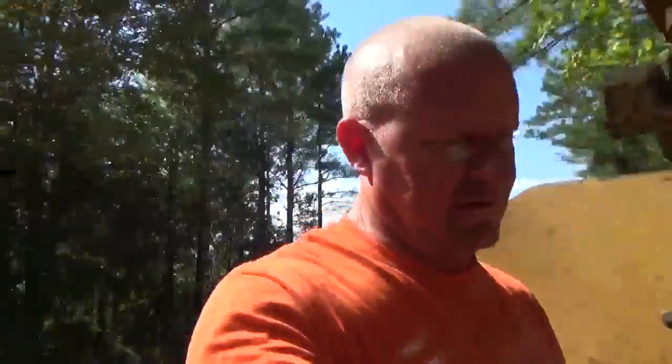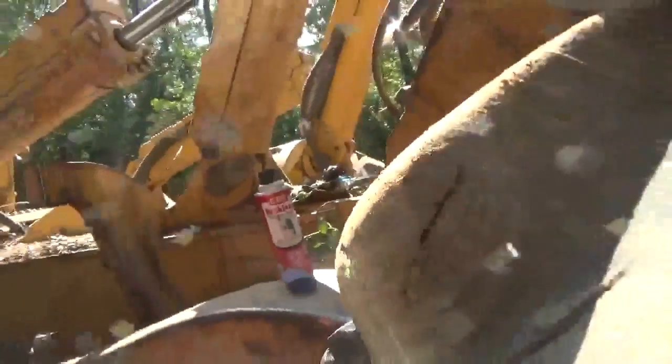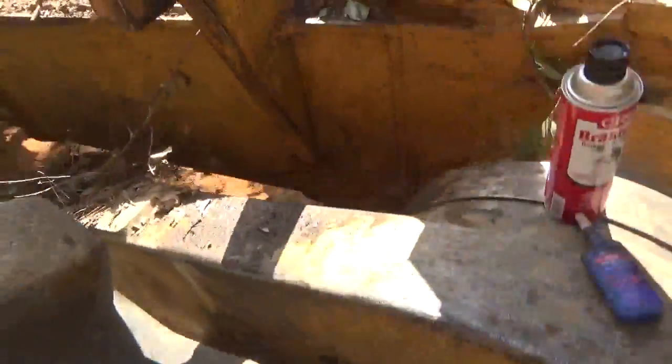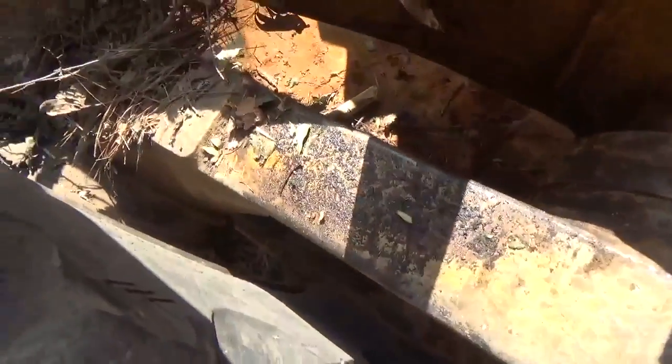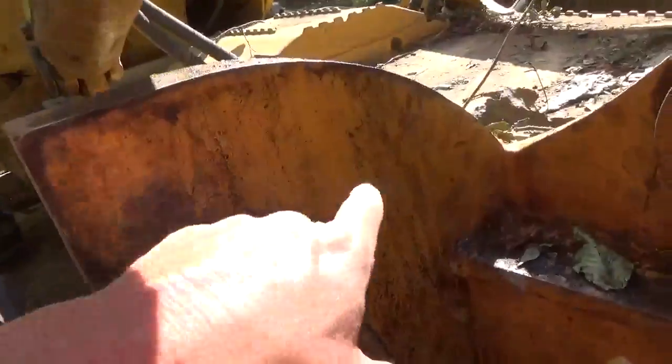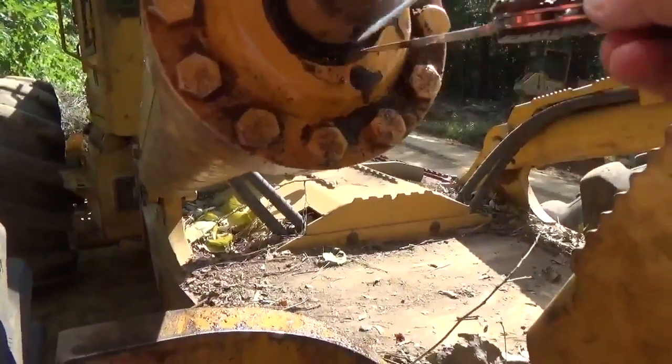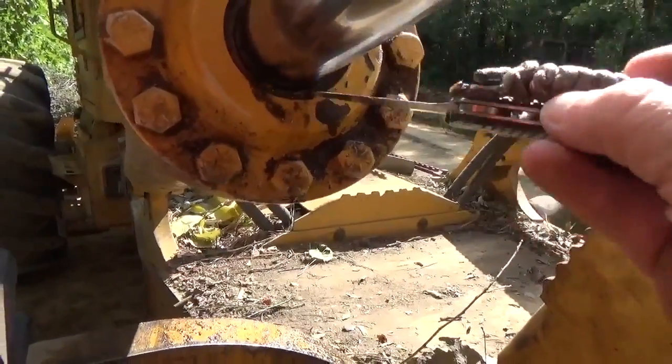The packing is blowed in here where those bubbles are coming out. So that's what I just talked to Derek about, was to go ahead and get the packing coming, because you can hang on, I'll climb up here where you can see. Because you can see where it's been leaking. It's oiled up all this stuff here and dripped down, and it's just a steady drip coming out of it now. So we'll get the packing for it, and we'll pack this thing this next week.